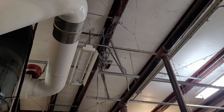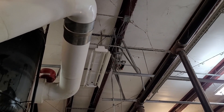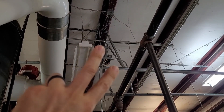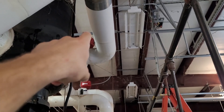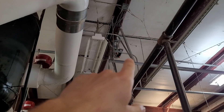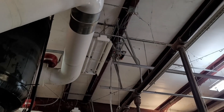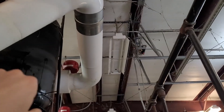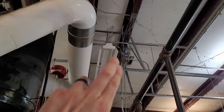These are RIB relays where the orange and yellow wires connect when the relay is energized. To bypass the relay I can go to the junction box and bundle the orange and yellow wires together so 120 volt flows through all the time, keeping the isolation valve open. I also need to disconnect the blue wire, because these are power-open power-close actuators — if the relay loses signal, blue also connects, and then you'd be powering open and closed simultaneously, which won't work. So: break blue, make orange and yellow.